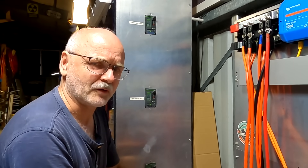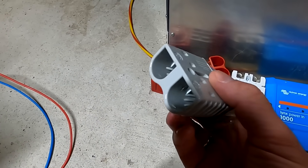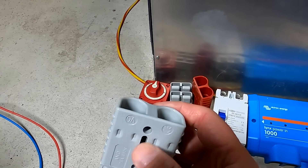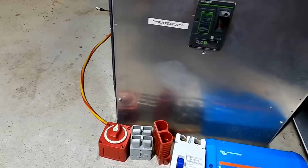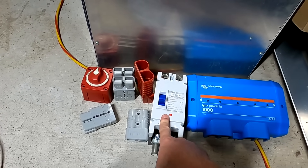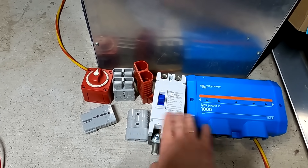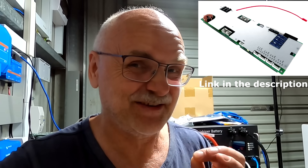It is now a few days later and I've thought about these options. Mounting Anderson connectors directly to our high-amp bus bar inside the shelf is not a good option because there's no fusing in between, and adding another main switch for just an Anderson connector - I haven't got enough space to get all the cabling done. From all these options, I'd now say the one with a main circuit breaker is the only viable option, because it gives peace of mind: when I turn it off, both positive and negative are disconnected from any additional batteries.